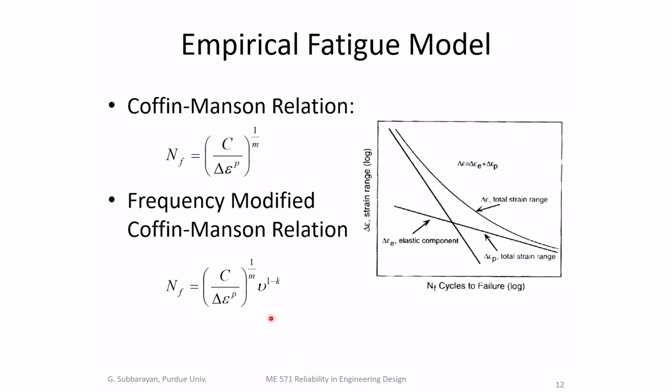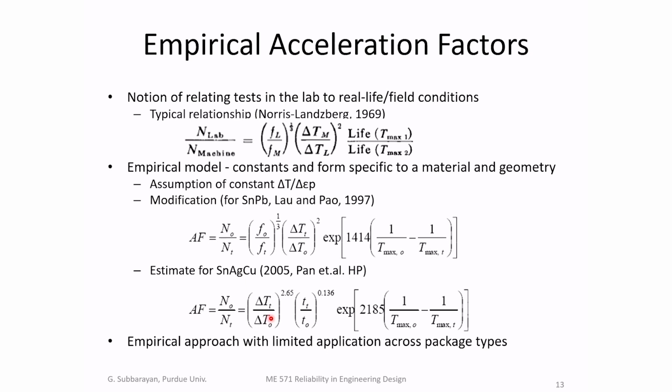These are all traditional fatigue modeling methods. This is not what we used, but this is how typically people model them. And our belief was that this is not a very good way to model because these are empirical. These are not actually following the crack growth process, and therefore their predictions are pretty poor. In fatigue, you will often have errors of 100%.